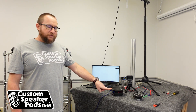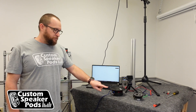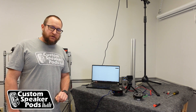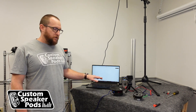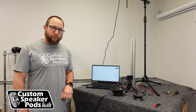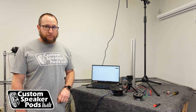I've already set the gains for this speaker so I know that the output wattage of the amplifier going to this speaker is 100 watts, but I have the gain for the tweeter turned all the way down. What we're going to do is play the white noise, turn the volume up, and adjust the gain on the tweeter in order to create a flat frequency response. Once we're done with that, we're going to measure the voltage that the amplifier is putting out in order to give the tweeter that much power.